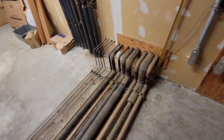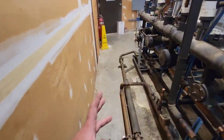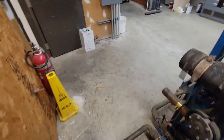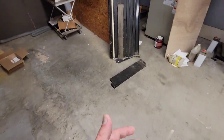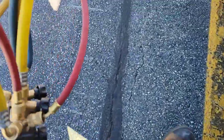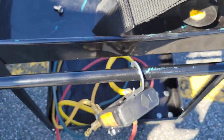Sorry, my voice is kind of shot — hope that helps you. That's what a split valve does in a nutshell: it shuts off one half of the condenser. The reason it does that is to keep the head pressure high enough so the whole system works. That was a video on split condensers — how they work. I'm going to do another video eventually — a theory video on why we even need them — so be on the lookout for that. Please like, subscribe, and hit the bell. Hope you learned something — that's how you do it.